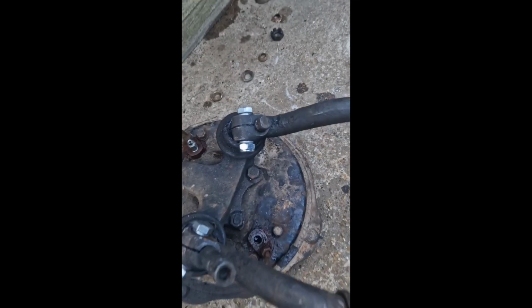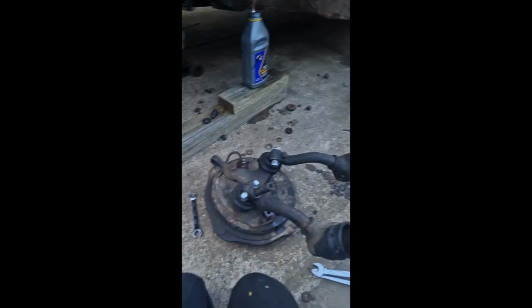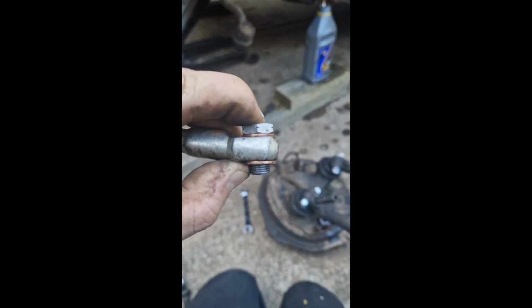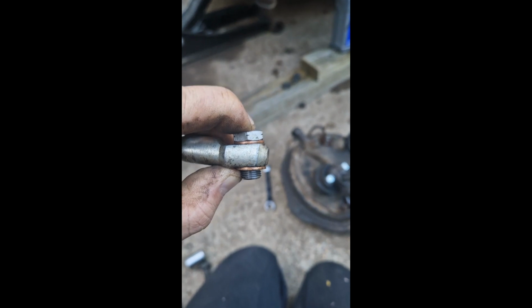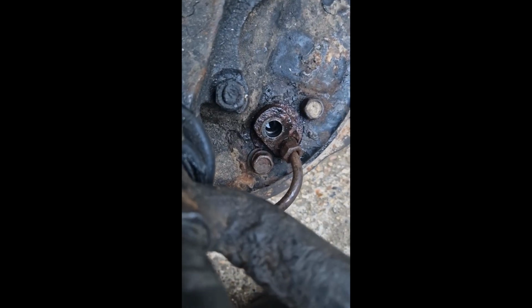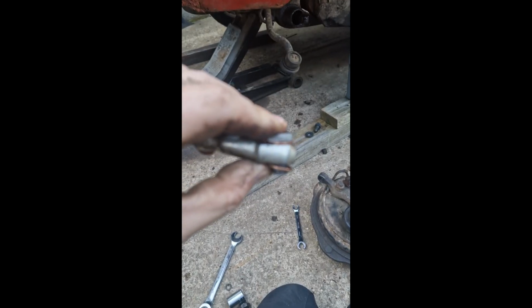50-year-old bolts, you know. Also, the reason why I'm trailering it whenever I'm not driving it is because the front brake cylinders leak, the rear cylinders leak, but I've just realised there's no thread that comes through the banjo. Hardly any thread, and that's obviously why. So I'm hopefully going to get some longer banjos, because it's not cross-threaded, it's pulled the thread out, but just on the end. So I'm hoping that if there you go, there's some thread there. If I get some longer banjo bolts, it should actually reach quite deep in there, because there's a lot of thread in there left over, but obviously that's not really good enough to pull from. So yeah, there we go.